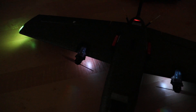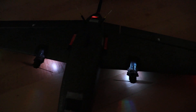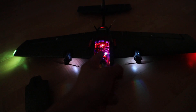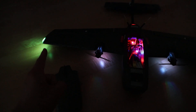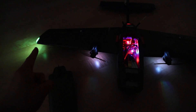The first tweak I'm going to show you is how to get two different colors of LEDs on each of the wings, and it's actually very simple. All you have to do is place one LED in between on one side or the other. You can see here I've left mine right there — it's nice and red, and that is LED number one. When you go into INAV or Betaflight in the LED configurations tab, this will be where you have your LED number two.